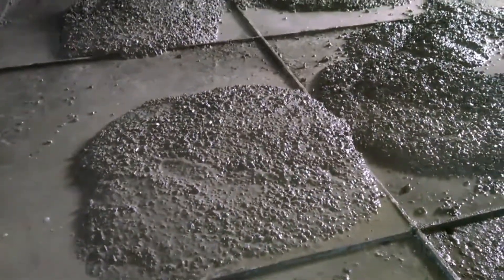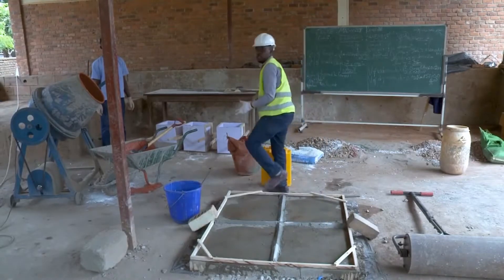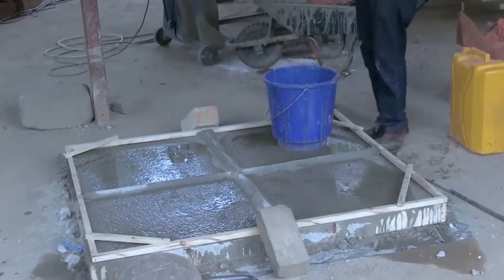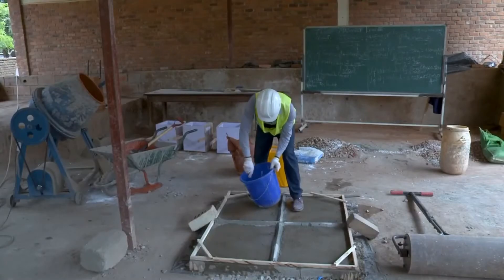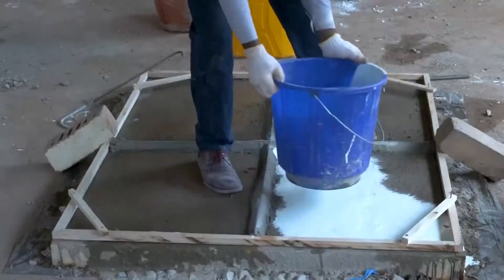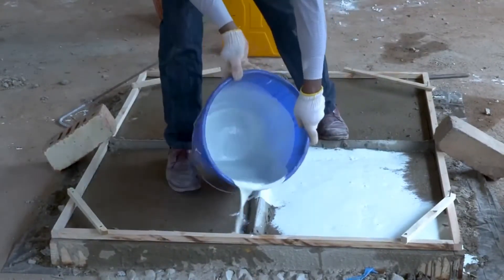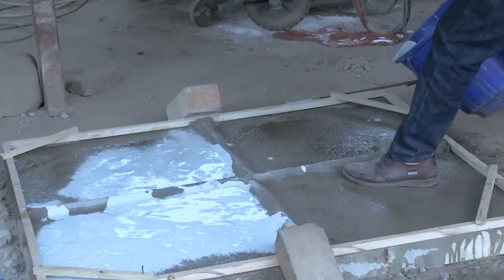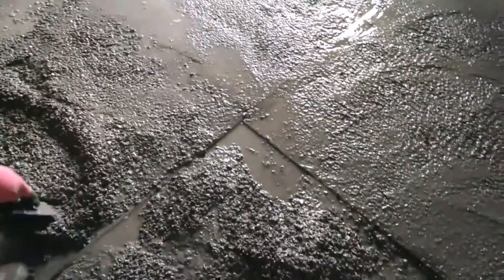The leveling of the surface: if floors are uneven, an installer can apply a fill epoxy which will level out the floor evenly for a nice smooth terrazzo finish. In order to place a terrazzo floor to an international standard, the preparation of the floor is paramount. The concrete floor must be free from dust, free from impurities, and not troweled to a smooth finish. It is optimum to sweep the concrete surface with a broom just before it sets, to give the key to the terrazzo, which allows the terrazzo floor to adhere to the concrete floor. The concrete floor must be straight and flat.